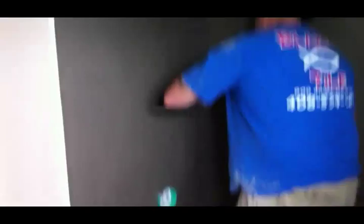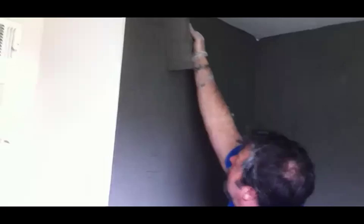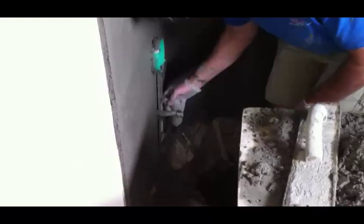This is the way to go when you float a wall. Backer board gets humps — it just follows the wall. This way you can get it plumb, flat, and smooth so when you set your tile it's so easy. I've done backer board jobs and I'll always want to float a tub or shower any day. There you have it — our job ready for tile. Flat, smooth, plumb, so easy to set. Floating is the only way to go.